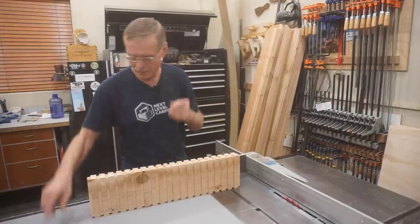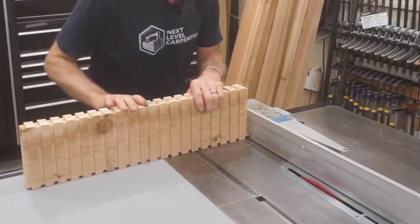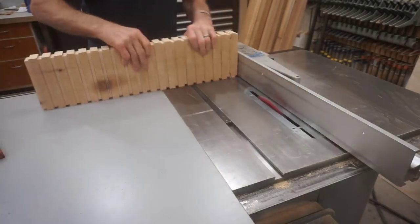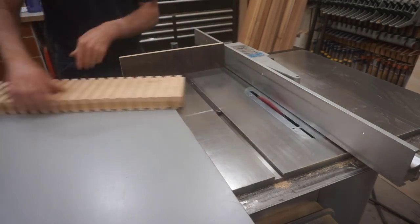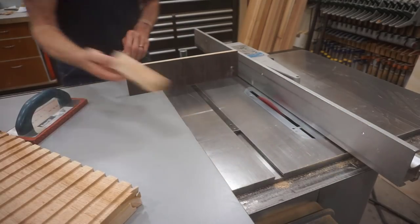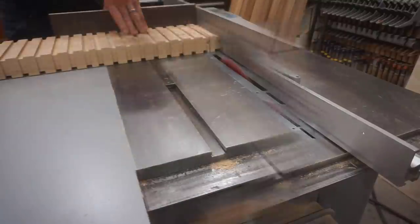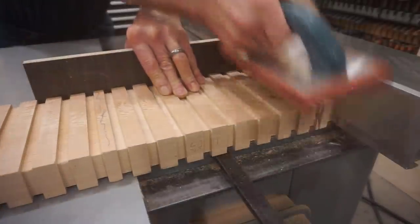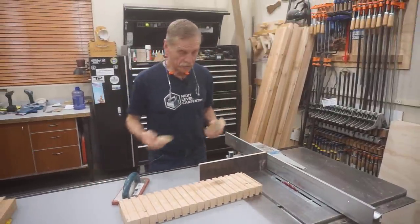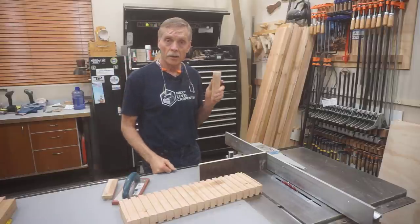And now boys and girls — it's showtime! With everything set up it's quick, easy, accurate, and safe to make the bevel cuts on each of these caps. It's important to note that I make the bevel cuts on the edges first before laying the workpiece down and making bevel cuts on each of the faces. I'm using a coarse rubber push block while making the final cut to carry the cap beyond the blade as it's released from the workpiece. And there it is — the first two of about 20 of these bevel-top wooden caps for plugging mortises on those posts.